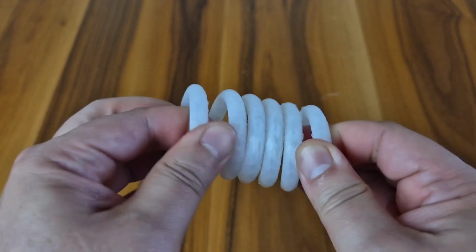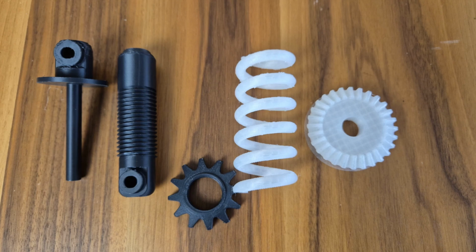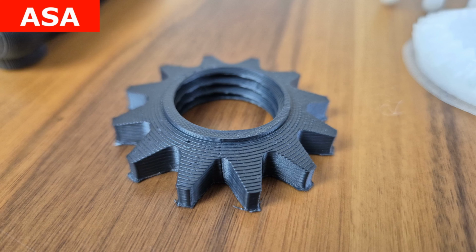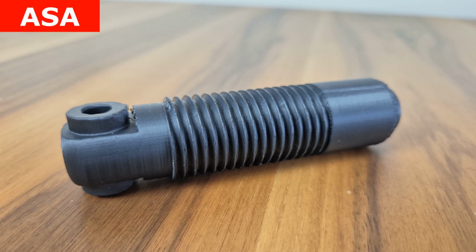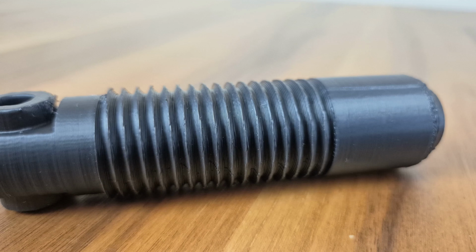In fact, I also did the printing of the other parts of the shock absorber with ASA filament. However, I couldn't assemble it due to a scaling issue, because this model was actually designed to be a keychain, and when I changed the scale, the parts no longer fit together. But functionally, it makes sense, because ASA is a material with high resistance to both heat and ultraviolet light. If such a shock absorber is to be used outdoors, these two materials can be preferred and used in combination.